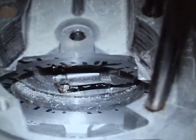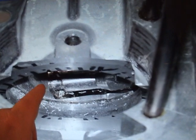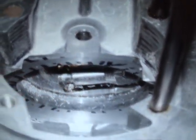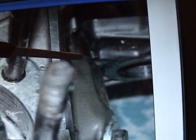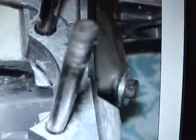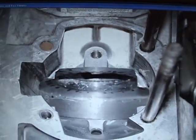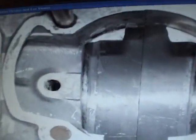There it is — it still has the oil plug installed. The oil plug needs to be taken out, and every bit of metal on all these sides has to be cleaned. What I do is put it in a dishwasher after I take it out. To get this oil plug out, it's JB welded in. I just take my little Dremel and go along the top of the plug until the JB weld is free, then pull it right out. When I want to put it back in, I put it back in and JB weld it up again — easy as you please. Both sides have been cut out here and here.